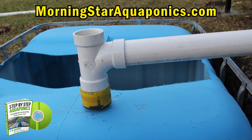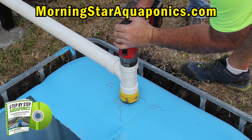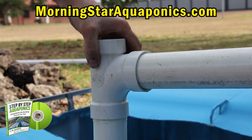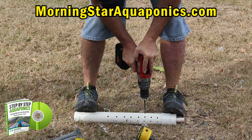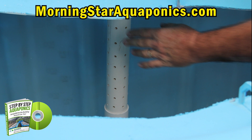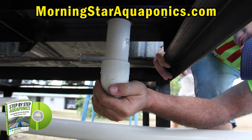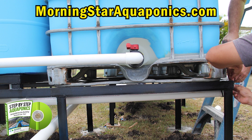Here I'm making measurements of where to cut the actual hole into the top of the sump pit. This apparatus that I'm making is an inlet into the sump pit — I purposely make it with perforated holes to help break the water and oxygenate the water for the fish. Here is a quick look at the drainage I'm putting at the bottom of the solids collector. It's very important that you drain off the solids on a weekly basis to ensure there's no solids buildup into the grow beds.